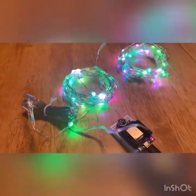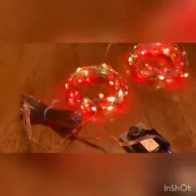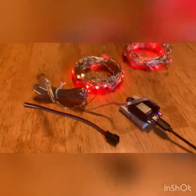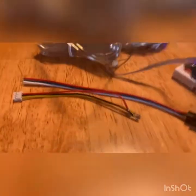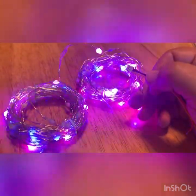Let's talk briefly about hooking these wires up. If you attach to the extension on it, this is pretty easy to either solder directly to your controller, or you can crimp on the pins for the JST connector, or even solder the JST connector on and then attach some heat shrink tube. This JST connector is the standard kind that comes with pretty much every LED strip. Lately I've been using JST PH pins or connectors. One reason is that the gauge of these wires matches the gauge of the JST PH wires, so it's a little easier to hook up.